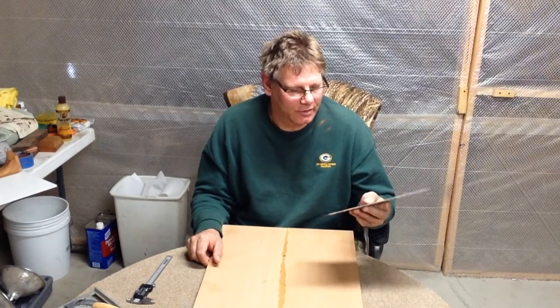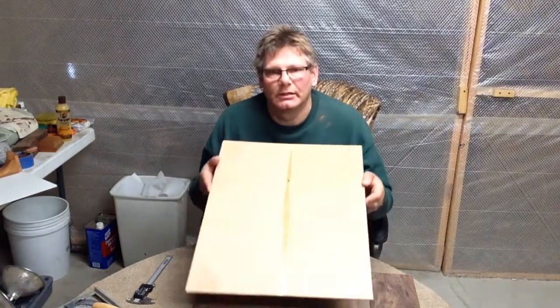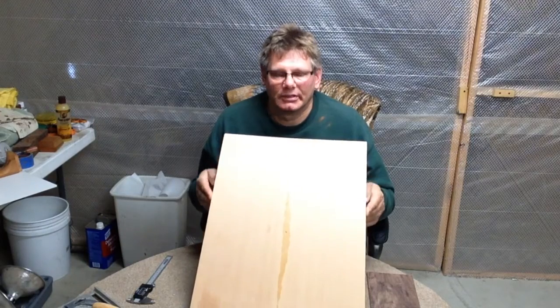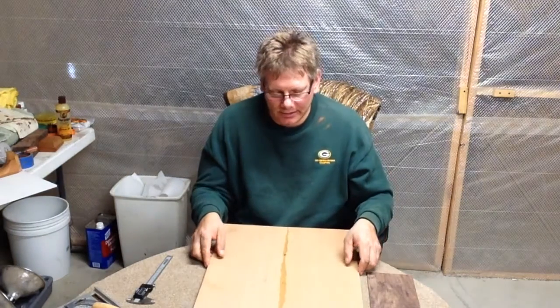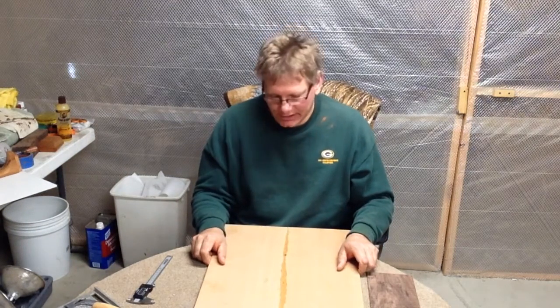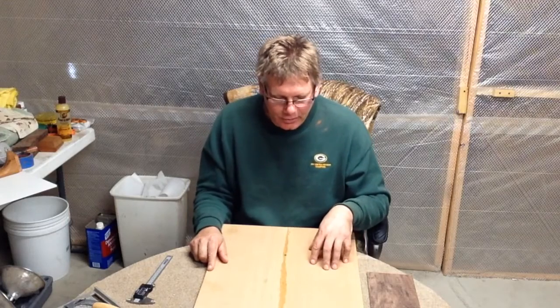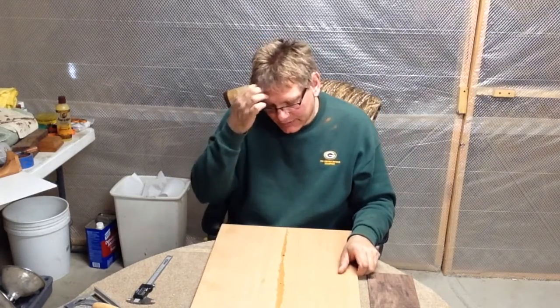And with a hardwood like that, there's a bigger chance of it splintering or cracking if you make it too thick. On the top, most crucial thickness on the instrument. This is Adirondack spruce. It's been aged 7 years. It's grade quadruple A, which is the highest grade you can purchase. And that means that all of the grain is exceptionally straight or true. There are no flaws, no waves, no knots, no starts, nothing in there. They're book matched. And those will make a very, very nice top.